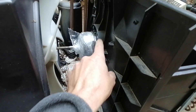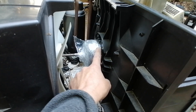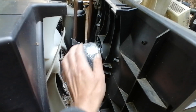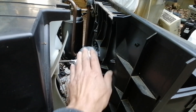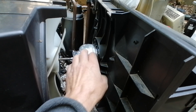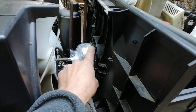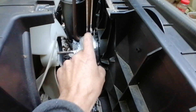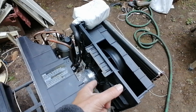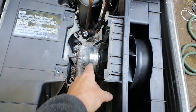I'm telling you from experience — I've cleaned a lot of air conditioners. When I first started, I used to spray these with the hose, and invariably I would always end up with several air conditioners with ruined bearings after I cleaned them. It's going to run fine for about a week or two, and then your bearings are going to start making that growling noise and might even seize up on you. At that point the bearings are ruined — you can't dry it out. So then you're looking at changing the bearings inside the fan motor. Much easier just to wrap it — it's going to save you a lot of grief.